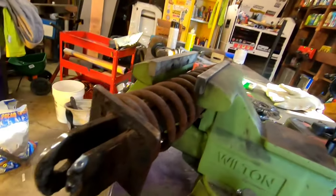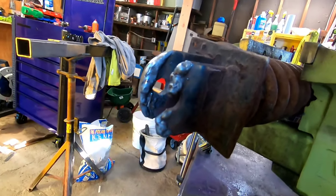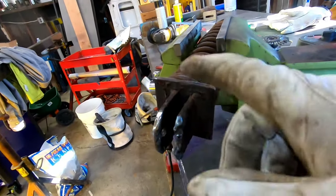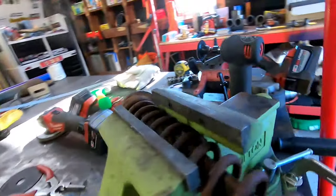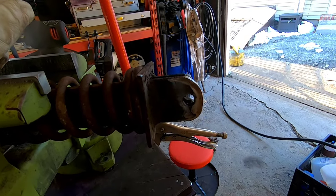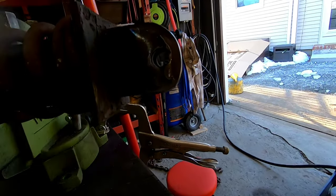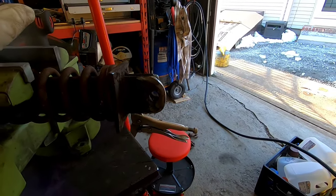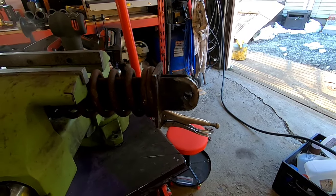I got that one side done. I'm going to clean the inside up. It's very crude, mind you, just building this up, but I'll probably put a couple more passes on here just to really beef it up, get my hole drilled, and yeah, the tops of these holes were still good, so if I can get a good contour on that, I think we're going to be in good shape, so let's do it.